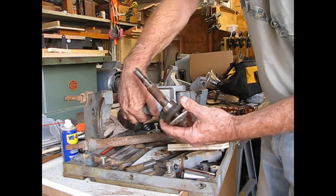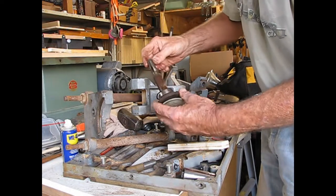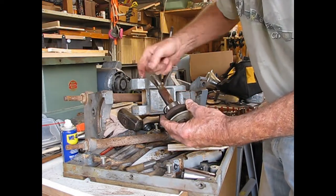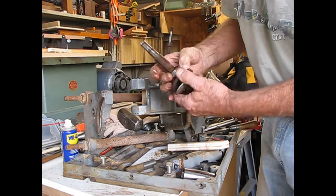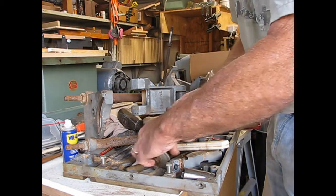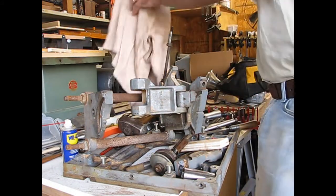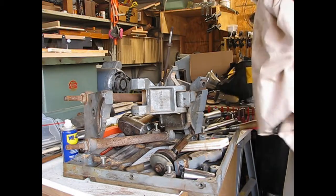And that drops our spindle out, and the bearing came out with it on that side, so there's no retainer nut on that side. It's just held in place pulling towards this side. I still have to get the spanner and get this one off to get the bearing out that side. I've got some on order. The bearings are available on Amazon, so should have a set of bearings here possibly by Wednesday. That's like 3 days, 3-4 days from now. And we'll get back to it.